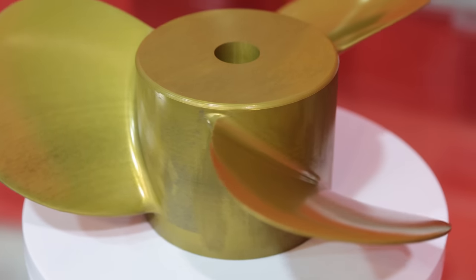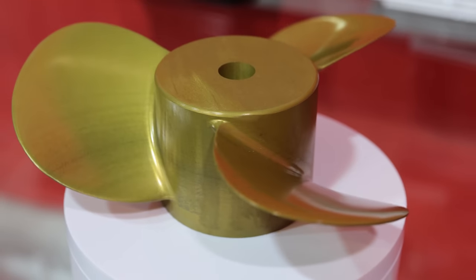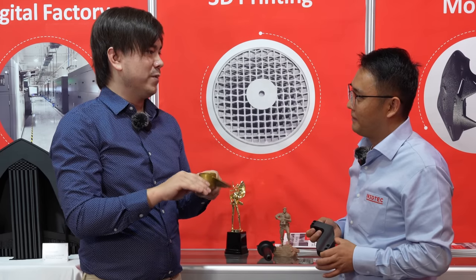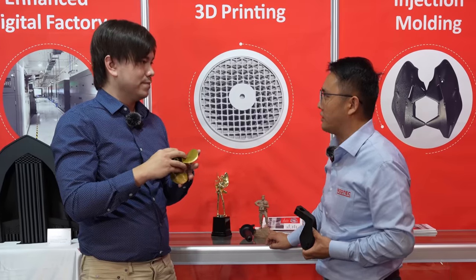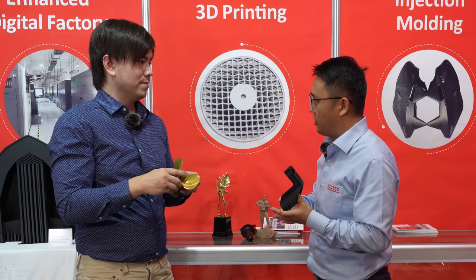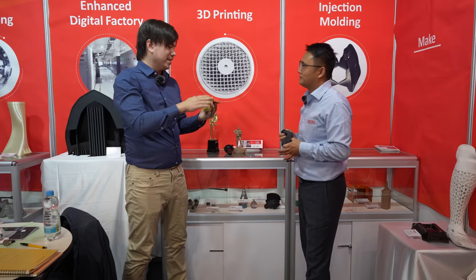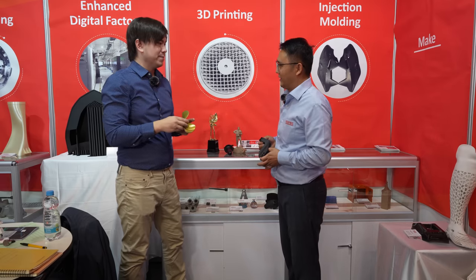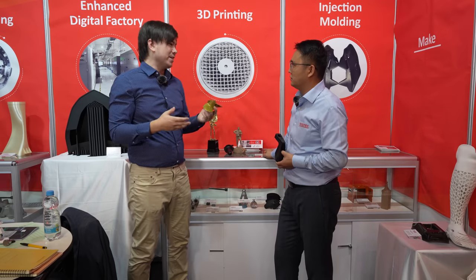This one is aluminum with an anodizing surface finish — and this was CNC machined? Yes, CNC machined. 3D printing also can do this kind of part, but the surface finish and tolerances from CNC machining are better than 3D printing. The surface finish on machined parts and the tolerances tend to be a little bit better. In metal printing, tolerance is around 0.2 millimeter — it's not bad. But after printing, we can do CNC machining to get a very high tolerance. It's really common to clean up flange faces and bore diameters when you're dealing with 3D printed parts — they get the net shape pretty good, but just the last decimal points of precision. It's the same with casting really.